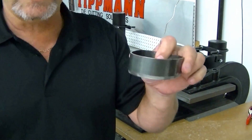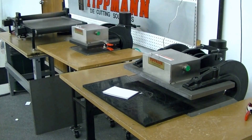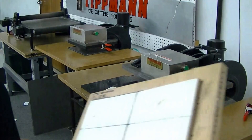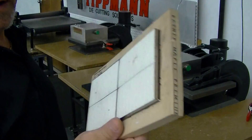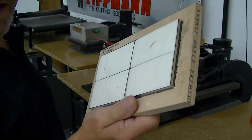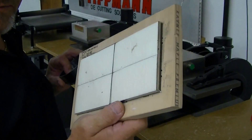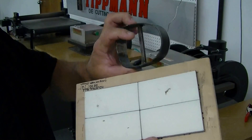This is our one and a quarter inch clicker die — we make these in house. If you want a steel rule die such as this, this is the kind of die that you can have made that has a little bit sharper blades. You can have multiple cavities, and you get twice as many lineal inches with this type of die than with the clicker die, due to the thickness of the blade.